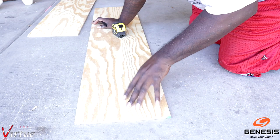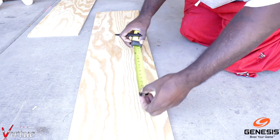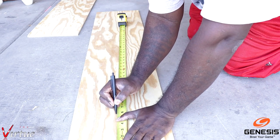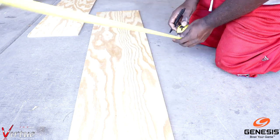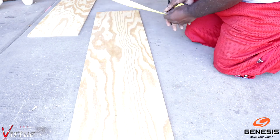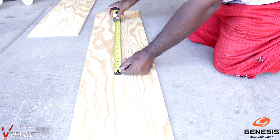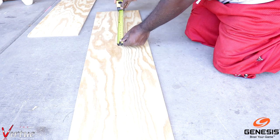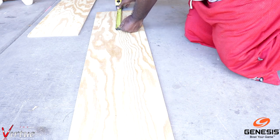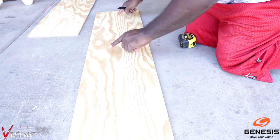Okay, so now you're gonna take your four shelves, and you're gonna prep and mark the holes. So the math I came up with, starting from left to right or whichever way you go: first measurement, 5.25. Off of the other side, come in 5.25 as well. Off of that 5.25, you can go 9 1/4. 9 1/4. And one more time at 9 1/4. And if you measure that, you got 9 1/4 as well, give or take a 16th. So you have 1, 2, 3, 4, 5 marks here.